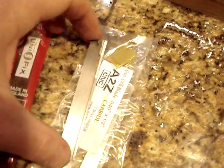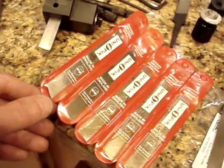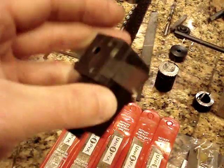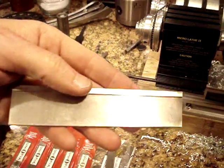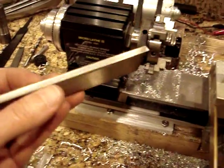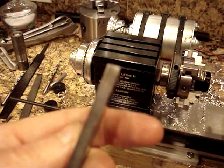You can see I've got some of my cutting bits. There's a cobalt one here. This is a little carbide-tipped one from your pal over at A to Z. These are some German high-speed steel ones that were just ridiculously inexpensive, so I bought them. And then this of course is the back side cutting setup from TAG with a high-speed steel bit. This is carbide — probably carbide tipped — that I bought on eBay, but I had my measurements wrong. It's probably the size of the whole lid; I think this goes with a South Bend 10, but it's too thick to use. The thin little guys are a lot better for parting off.